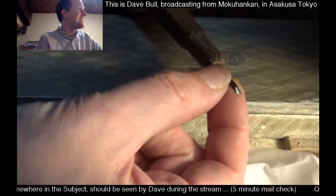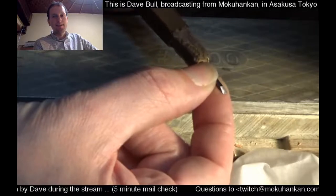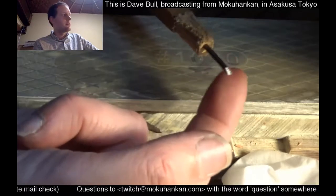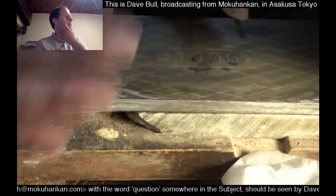That sharpening sounds nice. There's no more ASMR people, are we? So, yeah. And then check it. I'm looking against the light to see what's shiny and what's not shiny. And if I've done it well, right at the bottom here, under my finger, there's a little burr developing. There's a tiny burr on the flat side, because as I've been sharpening here on the tip, it bends the metal up.